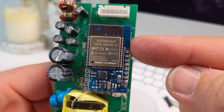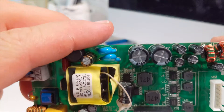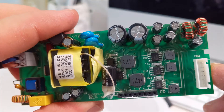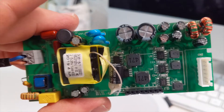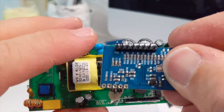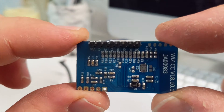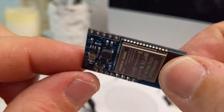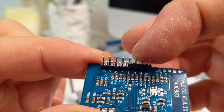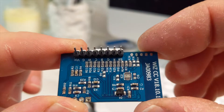It's got a standard ESP32 module in here. Underneath that ESP module are 5 MOSFETs — logic-level MOSFETs that, according to the datasheet, need 4.5 volts to achieve their proper RDS-on. As most would know, these only put out a 3.3V PWM signal. However, the voltage coming into this module, which I measured, is about 16 volts on the VCC pin. So there's probably something on this board that's putting out a voltage higher than 3.3V PWM. It's got the red, green, blue, cool white, warm white, and ground voltage outputs. I don't know what SB is — not sure whether SB is something important we need.